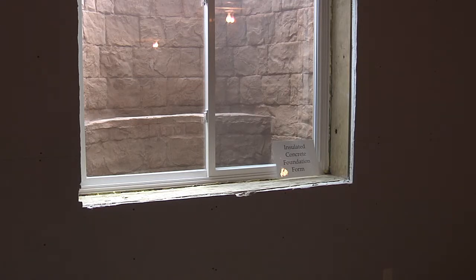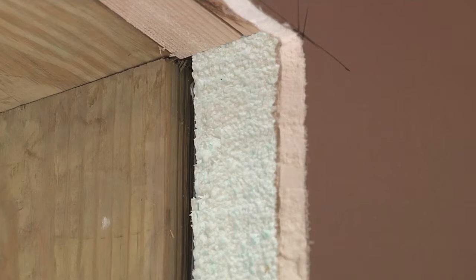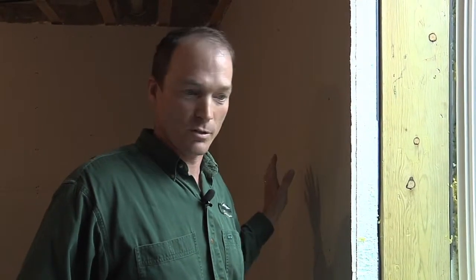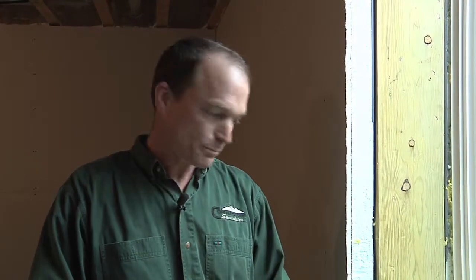It translates into a much warmer, safer basement. If the basement is unfinished, someone can come in — by code we sheetrock the walls already and put the electrical in, so it's already set up. Your costs are going to be even less; there's no framing on the outside walls to do. It's all ready to go — a quieter system, safer, and that much more thermally efficient too.